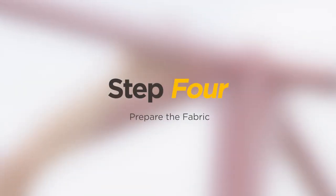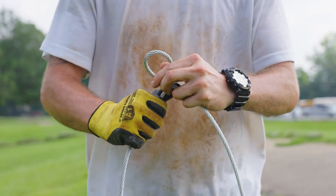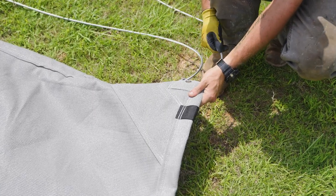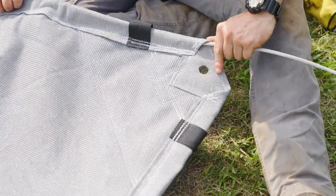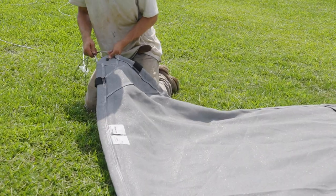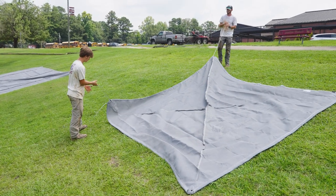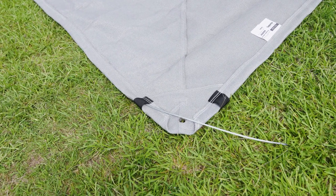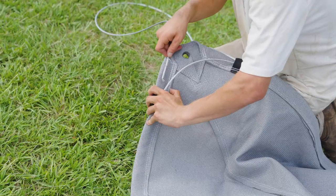Step 4: Prepare the fabric. Unroll the fabric with the hemmed side facing up and mark the center point of the cable. Insert the cable ends into both the left and right hems of one corner and feed the cable through both sides until it exits at the next two corners, ensuring the center point of the cable hasn't shifted from the original corner. Continue feeding the cable through the fabric's hem so that the cable ends will meet at the last corner. When the cable has reached the last corner, both ends of the cable will exit the hem opening beneath the black webbing strap. Cross the excess cable and tuck the remaining cable into the webbing strap.